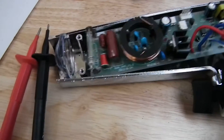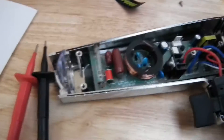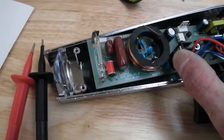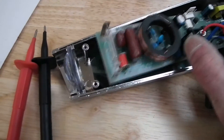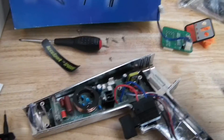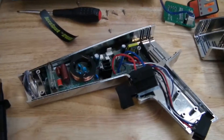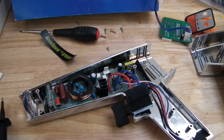In normal position it shouldn't touch the other casing — it's held in with a tiny screw — but if it was lifted up or loose in some way, it would short. I don't know if this is some sort of reject, but it's a poor design anyway: a conductive piece of plastic with high voltage. That's probably what caused the failure.